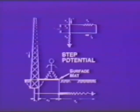About the best recommendation that can be made is the use of a localized mat at the base of the structure. It can either be a grounded mat or an insulating mat. Either one will create a situation at the base of that structure wherein there is no difference in potential between the man's feet. Now, you can see obviously what you've done here. You've moved the danger point outward from the base of the structure out to the edge of your mat. And you need to be aware of that problem.